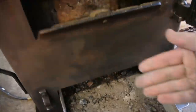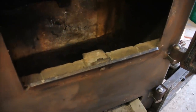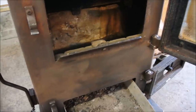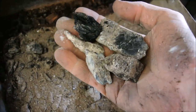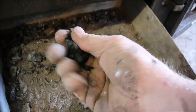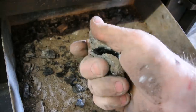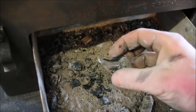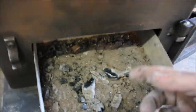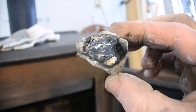A slight modification I've made so that I can use wood instead of coal is this — it's just an old piece of stainless steel that I cut away from an old gas grill that came with the property. You make do with what you have. Here are some pieces of coal that haven't quite burned. That's just regular wood ash, but this is a piece of anthracite. You can tell because of its metallic luster in the middle that it hasn't completely finished — that's because I'm not getting this hot enough to burn coal with just a wood fire. I'll show you the differences between the two types, because if you're not in coal country, you've likely never seen it before.